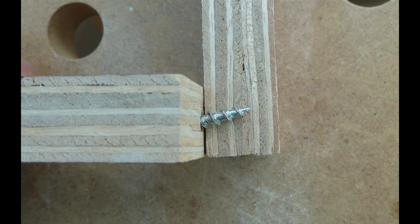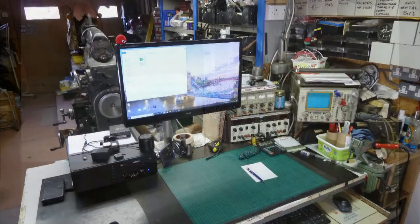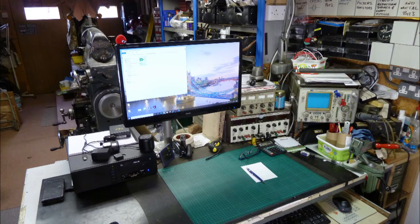As you tighten the screw, the side containing them will tend to drift in the direction the screws are pointing. It's always best to clamp the joint if possible and then tighten the screws. This will keep the drift down to a minimum. Let's have a look at a little project I did a month or so back.